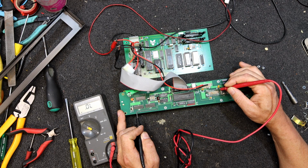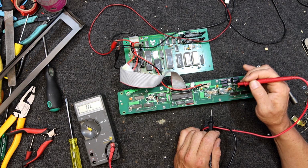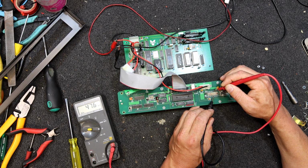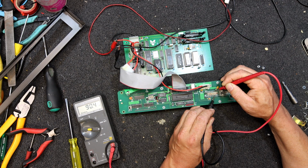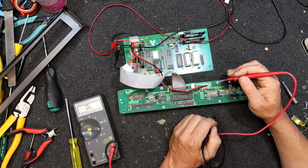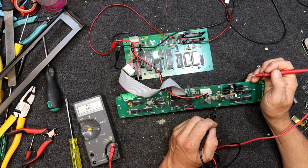So that's that resistor. That's a couple 150 ohm resistors. More likely they're coming out of a winding. I'm guessing out of there. I doubt we're going to have a high value resistor or anything. That's a 47k, 150 I think. Or 180 is that? What colour is it? It's actually 180 ohms I think. So maybe they're in parallel, since we've got 90. There's no electrolytic capacitors, just a couple of tantalums. Not a lot to fail, really.